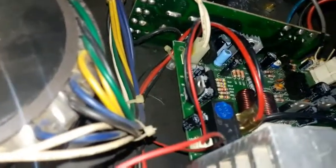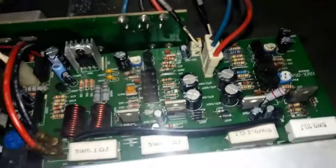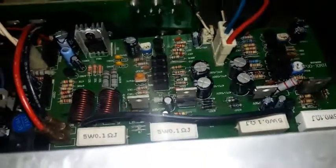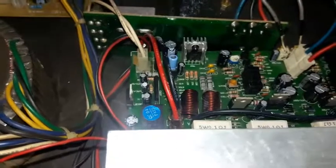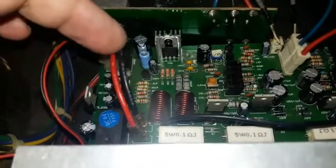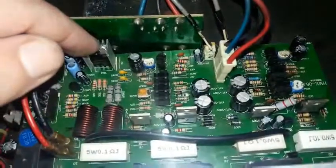The screw holder that which this board over here, there is two screws over here and here. You should mount those screws to a plastic, two-side screw plastic, which is as a bracket, so it can mount this bracket to the metal over here, and also mount this board to the other side. In order to screw those two screws tightly, you must bend this entire board in order to achieve that.